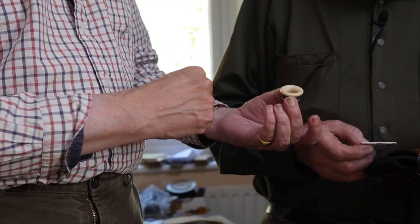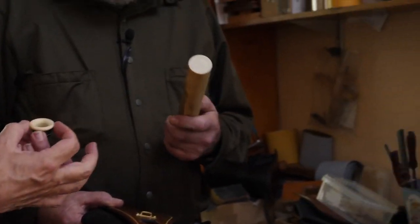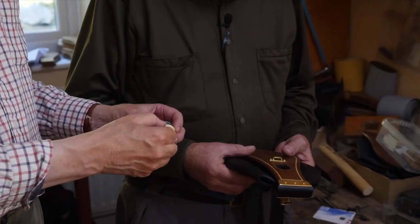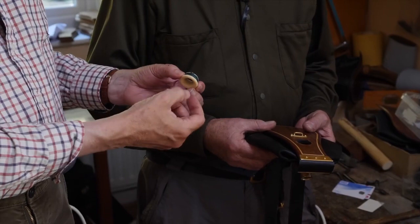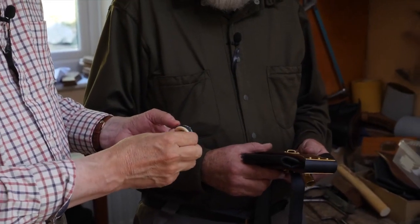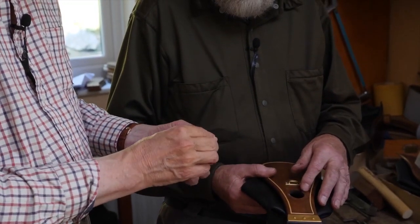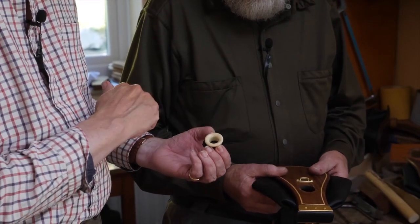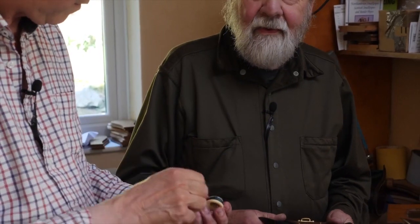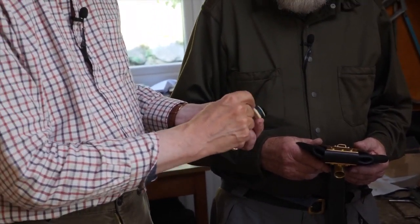And the diameters of that, do you know those offhand? 30mm, I think that is, and it's turned from that to fit this 25mm hole. So when you turn it, you turn it in on the inside, so you can get your credit cards underneath it, rather than a lot of them which are square to the wood. Yes, I like the looks of it as well. And the inner diameter fits your 25mm hole. The hole through the middle, do you know offhand what that diameter would be? 16mm. Okay. And I've seen a lot of bellows inlets that are angled, but yours is square. Yeah.